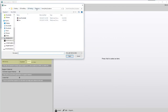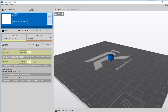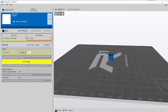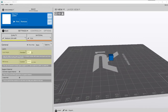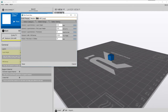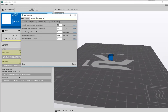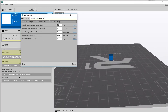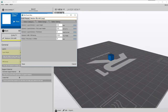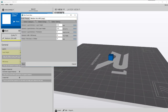We'll come in here and get our little 10mm cube — it loaded up real fast, it's just a little itty bitty cube. The first thing we're going to do is create a custom setting for it. Click duplicate. We're going to do this with no infill, just to save plastic. We're not trying to see if the cube is the right dimension. We're just trying to see if we can't get the cube to break free from the raft. That's our goal this week.